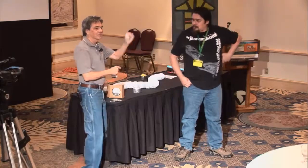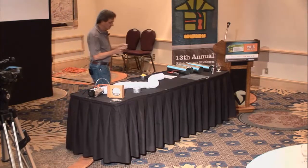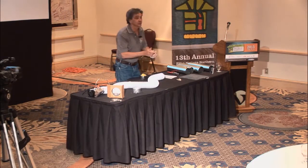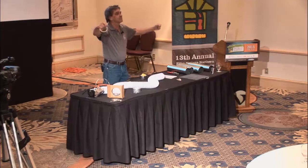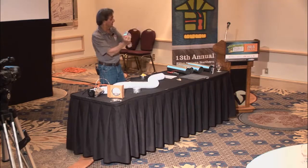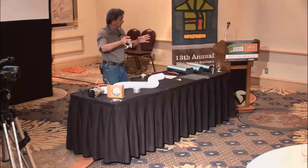What we do have testing on is that this stuff works pretty well. Certainly a lot better than the cloth duct tape. Now, in really professional installations, we will only use this in places where we want to open it later, like access hatches. Because you can take a knife, slit it, open it up, put it back, put more tape on the top, and everything works fine. You don't have to take the tape off. So if you need access, you use this. But the real permanent stuff is actually a mastic.